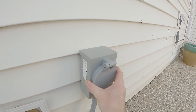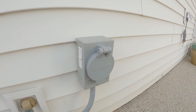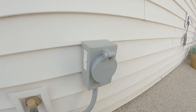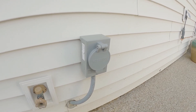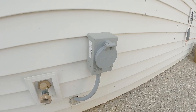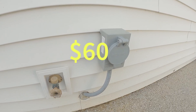This is what I use to plug the generator in on the side of the house — it's called a generator inlet. It's got four prongs. I think I got that from Home Depot, or maybe Amazon. I'll put a list of links in the description with my exact parts list and prices. I think I paid $30 for this. I was actually replacing an air conditioner compressor and had the inlet put in the spot where the electrical components were for the old compressor. I also had to get some 10-3 cable that ran to my electrical panel, and then I had to get the generator interlock, which cost about $60. I'll show that to you in a little bit.